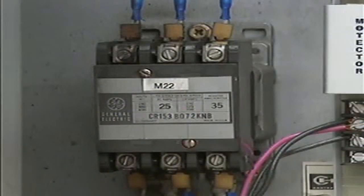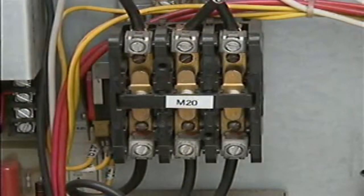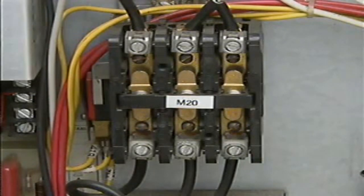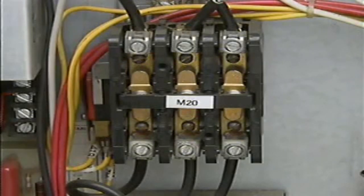In this part, we'll look at a typical magnetic contactor used in AC motor controllers and see how it operates to complete or interrupt the circuit between a power source and a motor. A magnetic contactor is a key part of any magnetic motor controller because it directly controls the power to the motor. Most magnetic contactors have three sets of contacts, one for each phase in the three-phase AC circuit. A contactor may also have additional sets of contacts called auxiliary contacts, which are usually attached to the armature and operated by it. These contacts are used to perform auxiliary control functions such as providing current for indicating lights used to show whether a motor is on or off.